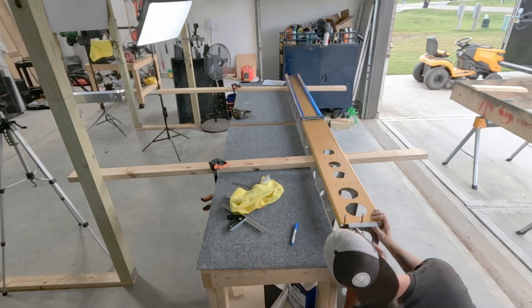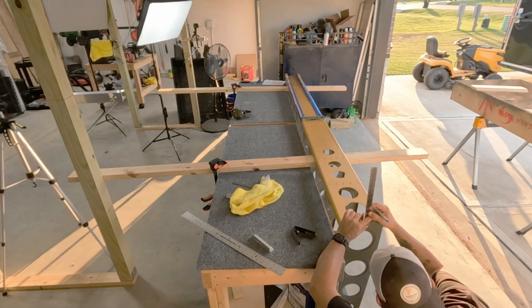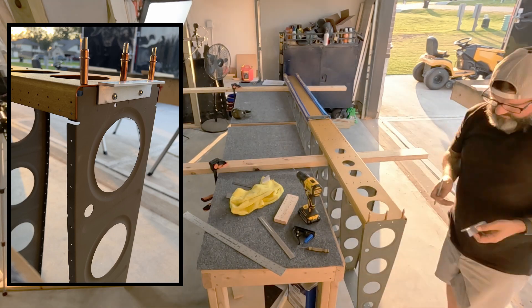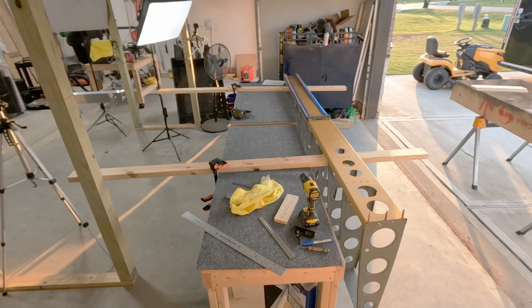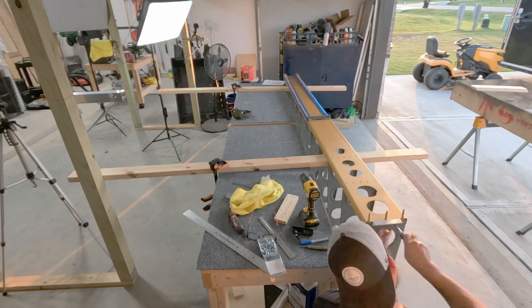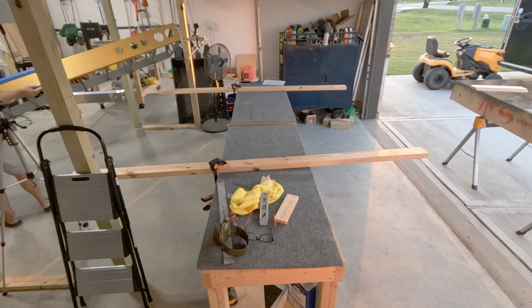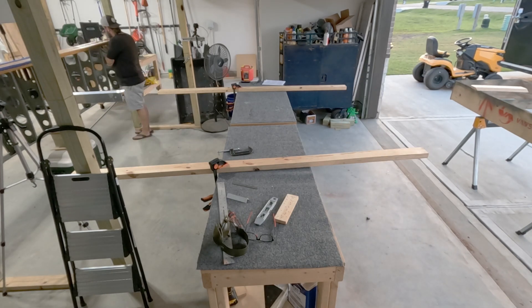This is a clever little trick with two-by-fours that I saw on the Plain Lady channel, to hang the wings and work on them. What I'm doing here is fabricating a little piece of angle and fitting it to the outboard rib with three-sixteenth screws, so there's an actual hanger or mounting point so it can hang on the wing stands. It's not super precision work, but I do want it to lay flush, so I'm measuring so that the extended portion of that hanger is almost like an extension of the spar itself — flush with where the spar would end if it continued.